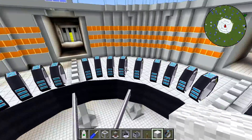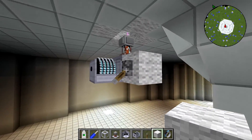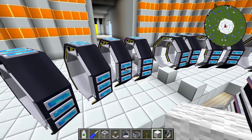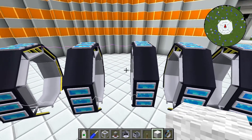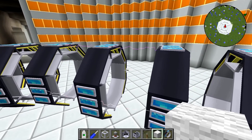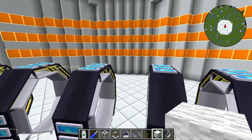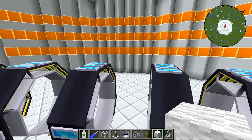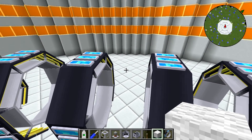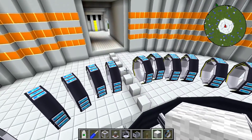It works well for me. Now, the colors of the static jumping between the toroids will change. If I turn the power off, you'll notice that there are still lightning bolts because there's still a storage charge traveling. But the colors are going to change. From what I remember, this pinkish-purplish color is what you want to get to. Blue means there's not enough. Then it goes down to white and yellow — still not enough — and it will actually go black, which is really not enough. So you want to get it to that nice pink color.